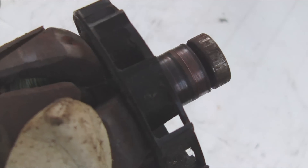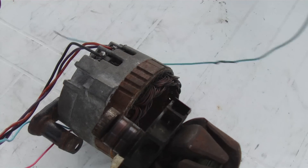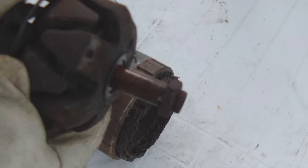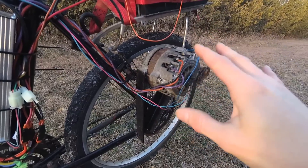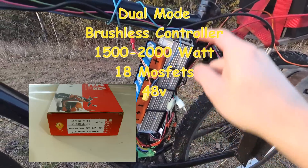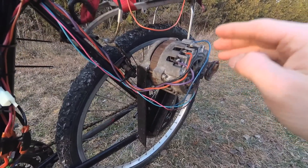The next thing you're going to have to do is add a connection point to the slip rings on the rotor. What I've done is connected two separate wires to each brush contact. When you apply voltage to these wires it's going to energize the rotor and turn it into an electromagnet, so we don't need a permanent magnet rotor for this. I'm not using Hall sensors on this alternator — I'm just using a dual mode controller to power it. Dual mode means you can use it with Hall sensors or without, and I did not add Hall sensors to this alternator.